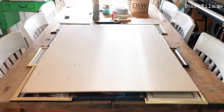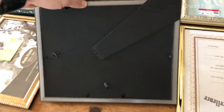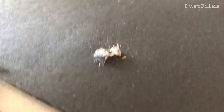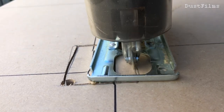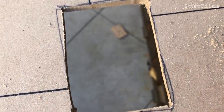I traced all the frames exactly in place so I'd know how they'd all fit together later like a puzzle. I wanted the frames to lay perfectly flat, so I tore off any additional hardware like little hooks or stands. There are four little gaps in between some of the frames, and I wanted to make sure you could still see through those. Using the outlines as a guide, I used a step drill bit to make initial holes and then a jigsaw to cut the sections out.